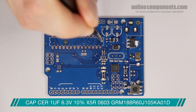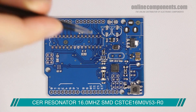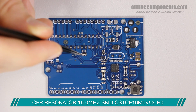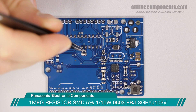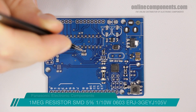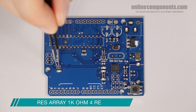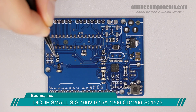We then have another capacitor to clean up the power line going directly to a 16 MHz ceramic resonator for the main microcontroller. You'll notice that this does not have the two external capacitors, as this resonator has internal capacitors. Also, as a ceramic resonator versus a crystal oscillator, it isn't as precise but is still quite small and inexpensive. Finally, on the other side of the board is an LED, resistor array, and protective diode to show the ICSP programming status and protect against transients on the power line.